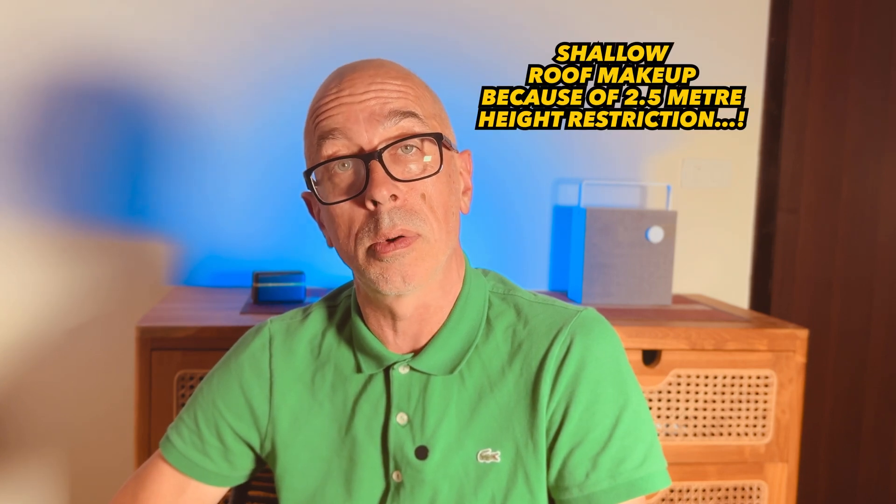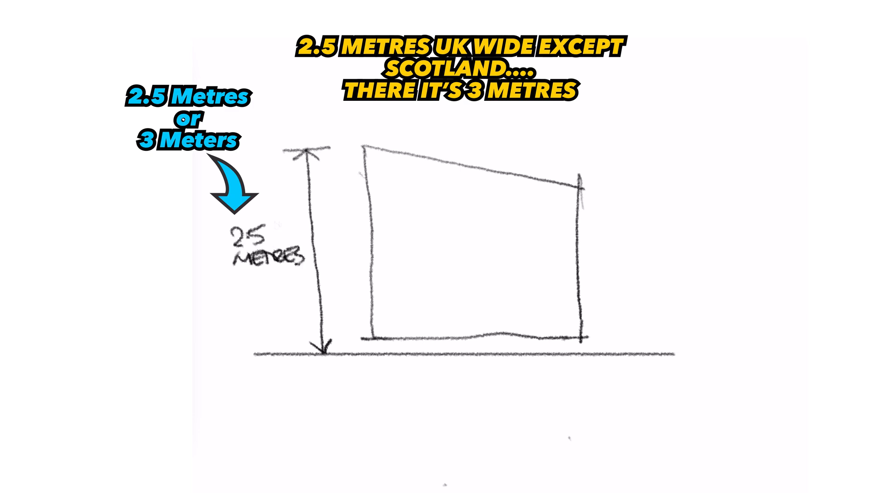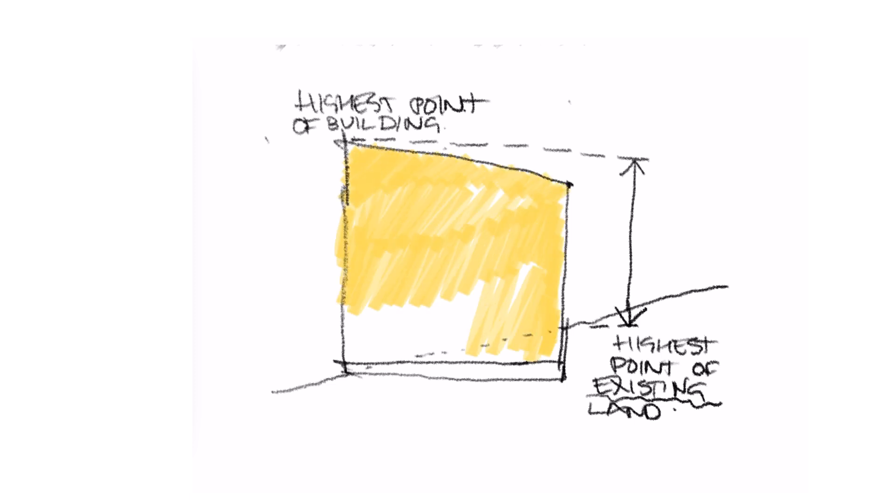I understand why they're doing it — how else can you get at least some insulation in there without making the roof makeup very deep and therefore annoying the neighbors and going against planning rules? Well, actually you can, and I'm going to show you how. You need to be within height guidelines when you're within a certain distance of the boundary. You do have a bit more latitude if your site is sloping, since you always take the height dimension from the highest adjacent natural ground level to the highest part of the build. You do need to leave the original level intact next to the building, and if you're in Scotland it's a little bit different — it's three meters but the height is measured from the lowest point.